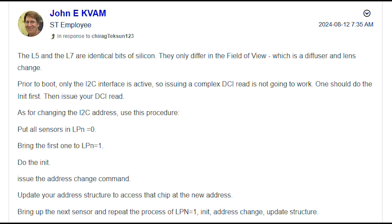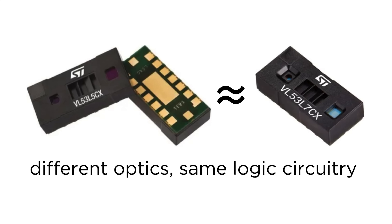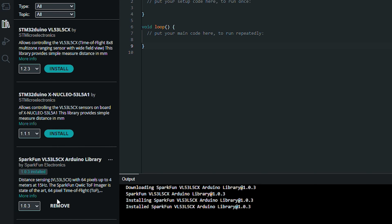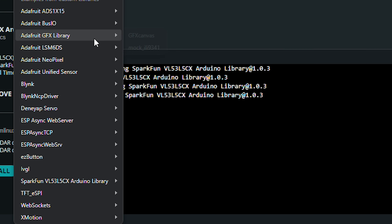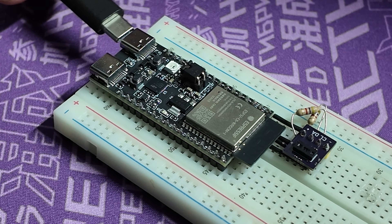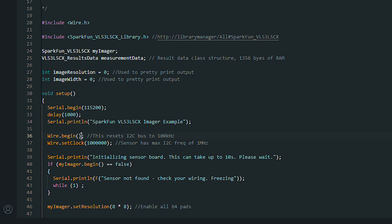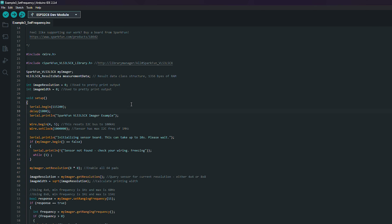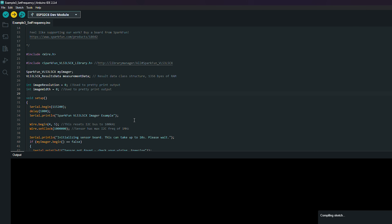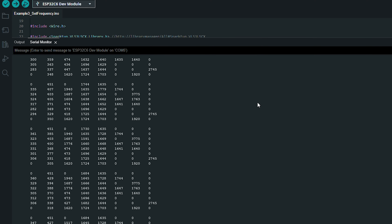Let's start with how to set up this sensor in Arduino. Since the VL53L5CX and VL53L7CX are completely hardware and driver compatible — in fact it's the same chip inside with different optics — we're first going to download the SparkFun VL53L5CX Arduino library. Once that's finished, open up Example 3, Set Frequency. Here I have an ESP32 C6, connected to the sensor through GPIO4 and 5 for the data and clock pins respectively. After changing those pins in code, scroll down to where you set resolution and frequency, change those to your liking, and upload. Note that this sensor is only compatible with microcontrollers with enough flash space to fit the 84 kilobytes of firmware loaded to the sensor on startup, so double-check by compiling your project before anything else.